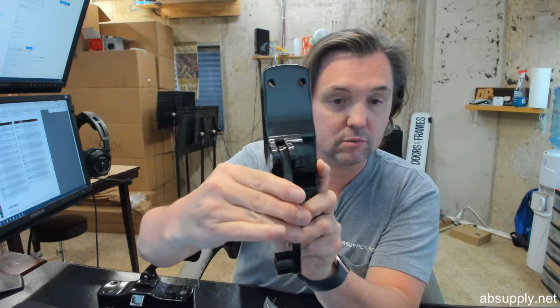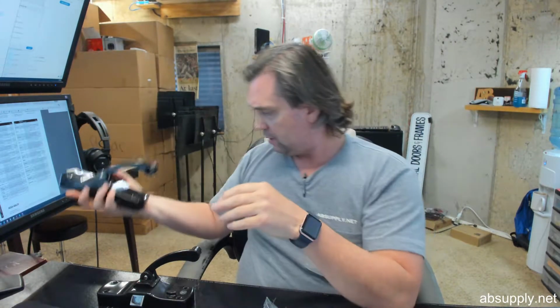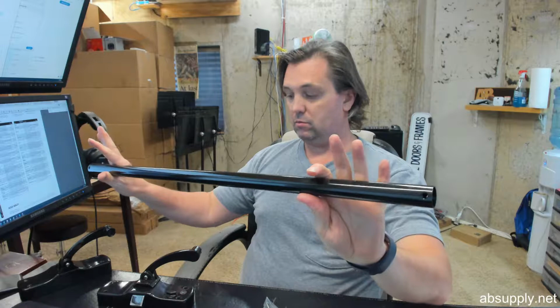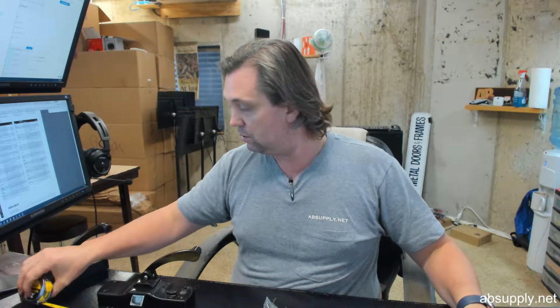This is the head case. Of course, we've got then the hinge case. Obviously the same, just without the latch bolt. Let's go over some basic dimensions after I show you the crossbar, made of steel. Now, this is going to be appropriate for 3-foot doors. The length on this rod is 30-inch, so by the time you get it installed, it'll be perfect for a 3-foot door.